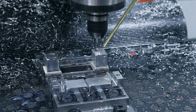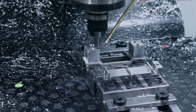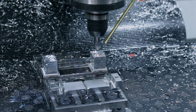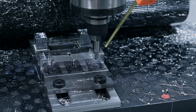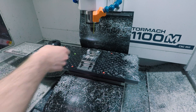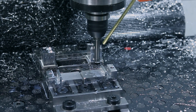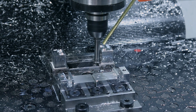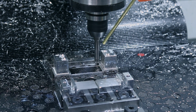I plunged a little too aggressively there with this chamfer countersink but I didn't notice any real ill effects so I just let this cycle finish running and tweaked it before the next time. Here I'm using a thread mill to pre-backside chamfer these parts before they're brought to final thickness in op 2. 60 degrees isn't ideal but I wanted the rigidity of this tool — I didn't have anything that was 90 and it worked out fine.